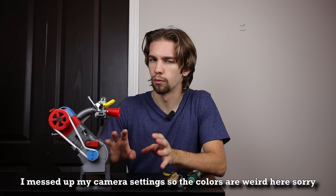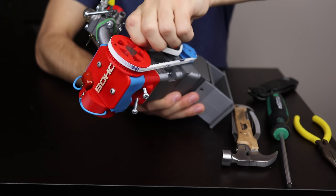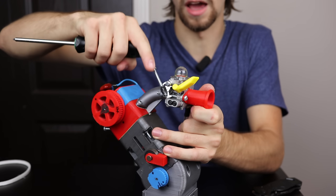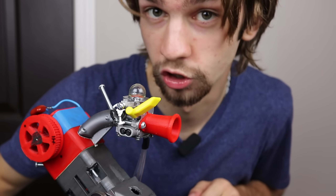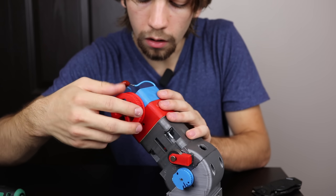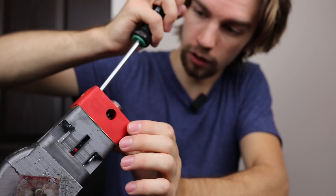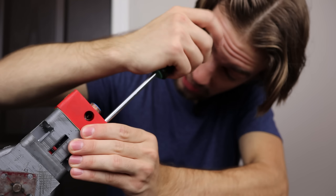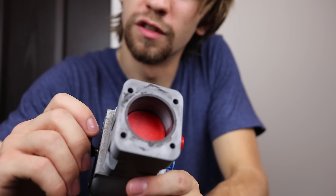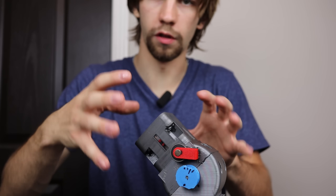This is kind of the 'what's inside' portion of the video where I'm gonna take this thing apart and find out what broke on it. I'm pretty sure it's something to do with the head. First order of business is to get this timing belt off — it's all greasy. And see what is wrong in the valve train. The exhaust valve has been permanently smashed down. I'm really curious to see if there's any charring or burn marks on the inside — that would be pretty epic. It smells like charcoal. You can see the cylinder is okay, and it still has perfect vacuum, so there's nothing wrong with the cylinder.